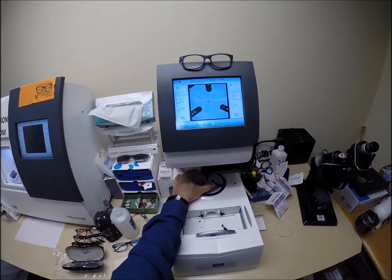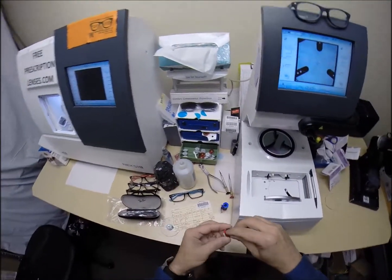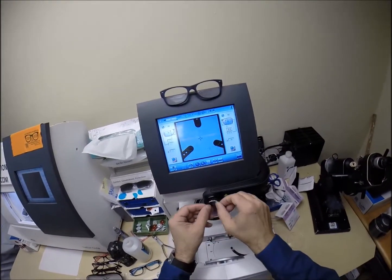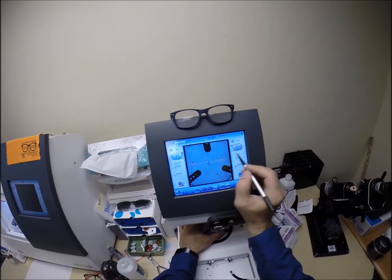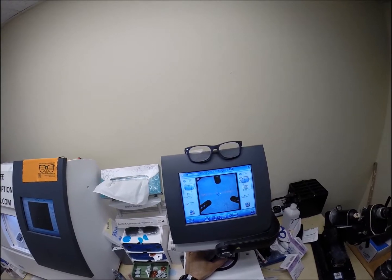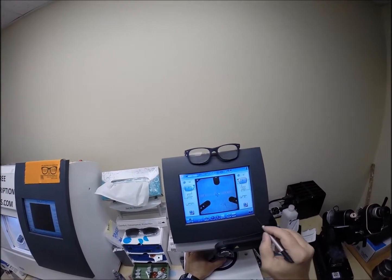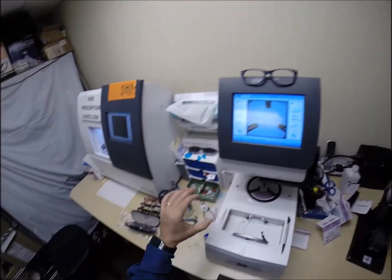Hit that button. The arm's going to come down and place the block onto the right lens. We're going to do the same thing now for the lens that ain't right — just like me. Magnet lines up with that magnet. Grab the left lens. This has mirrored the right side. Your pupillary distance for your left is 32, the same optical center height. Get everything lined up and hit that button. The arm comes down and places the block onto the left lens.